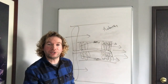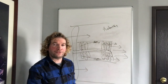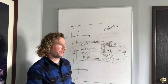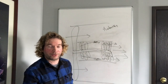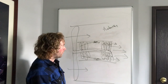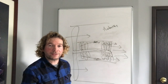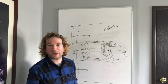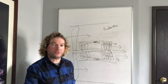Unfortunately, the fan gets bigger as you increase the bypass ratio, and that eventually creates more drag — so you can't go super fast with an ultra-high bypass engine. You also run into ground clearance problems because the engine is so large you can't hang it under the wings without massive landing gear. So turbofans that want to go fast are medium bypass, while more efficient ones use bigger high bypass or ultra-high bypass engines that go slower but do it more efficiently.